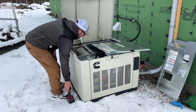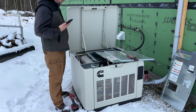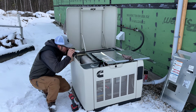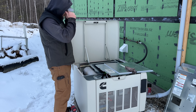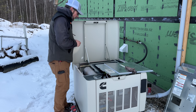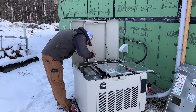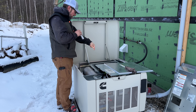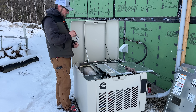I don't know if it was overfull and it was coming out of the dipstick tube or what. I have no idea where it would be coming from. We are going to start the generator and see if we can observe it. I'm not seeing any leaks running. Sometimes they coat motors from the factory with an oil coating — I don't know if that's what that is. What I'm going to do is clean up where the oil is, run it for a while, and see if we get any new oil. But as of right now I'm not seeing anything leaking.